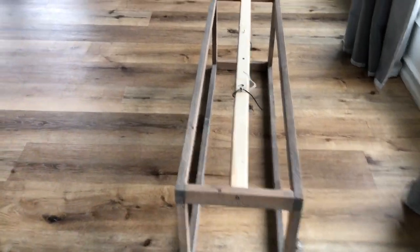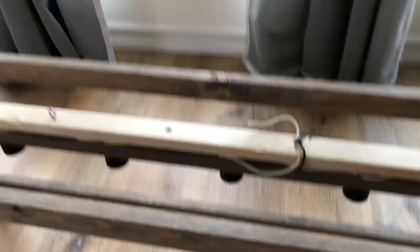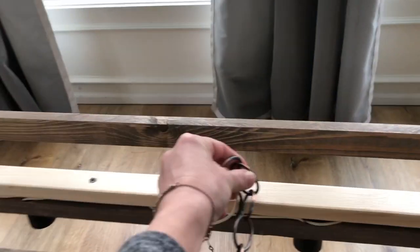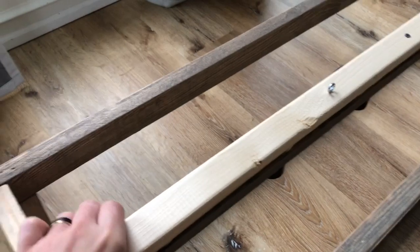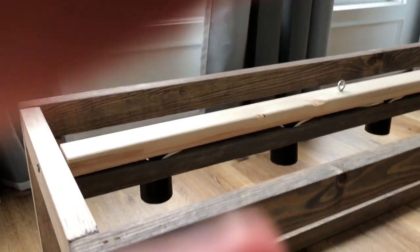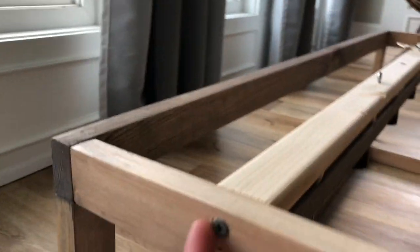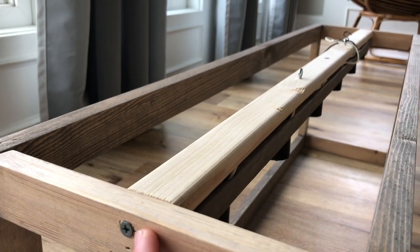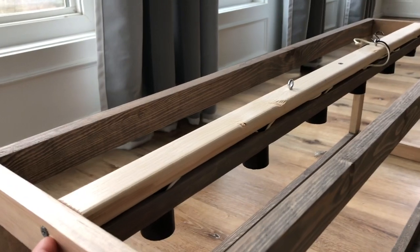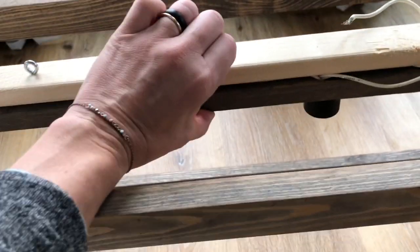For the reinforcement of the cross beam you can see I have my eye hooks — everything set — and then I can just attach it onto the hook. The wires ran across the top of the other piece. I decided to use a screw on this one and drilled pilot holes first so the wood wouldn't split, then secured it to the bottom piece in the middle.